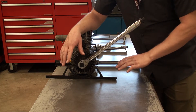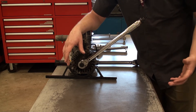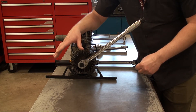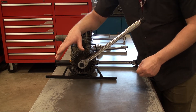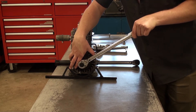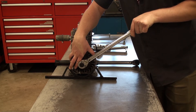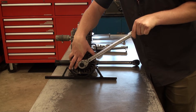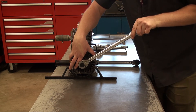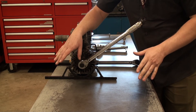Like all the wrenches, that doesn't mean it won't let me tighten anymore — I can certainly over-tighten still. So once I hear that click, I need to stop, because I can continue tightening past the click and still strip or break a bolt. Once it clicks, I'm tight enough. That's the click — a slight little bend and a click. If I continued pushing down after the click, that would be over-tightening the bolt.